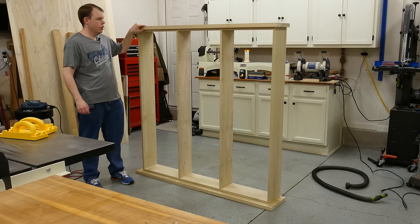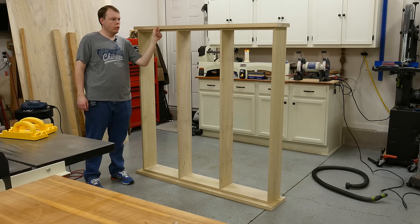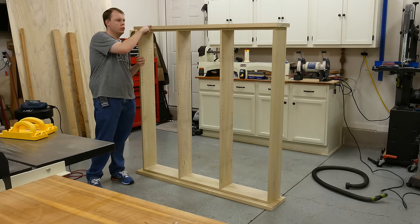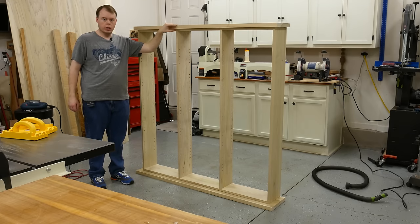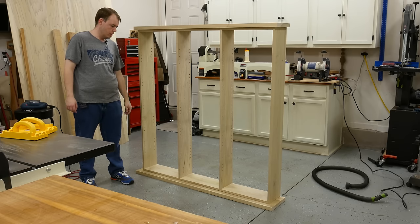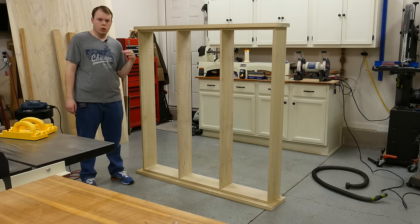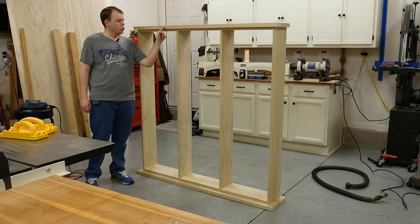This cabinet is going to have a sub top and a sub base. I've milled those up to roughly an inch and a quarter thick because my friend also wanted me to put a curve in the top like I did on my wall-hanging cabinet. The top has an overhang of one inch all the way around except flush with the back, and the bottom base has a two-inch reveal all the way around and is flush on the back. The base is also an inch and a quarter, and I'm going to put a profile around three sides using an ogee bit on my router.